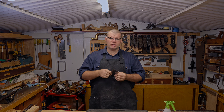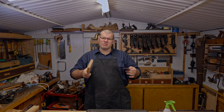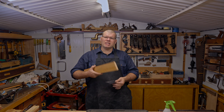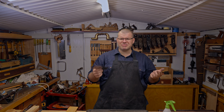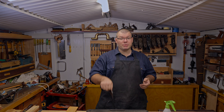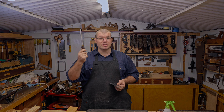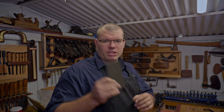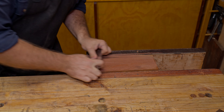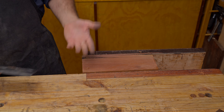I'm going to break this down into two sections. There's a more rough way of doing this if you're just doing rough removal — removing finish off something, or doing a bigger area that's not your final finish — and we can create what's really a quick burr. We're going to do the quick burr first, and then we'll move into how to actually turn the burr for a finer, more refined result using the burnisher. Just before I show you the first process, I want to show you the state the scraper is currently in — we're not really doing anything more than just pulling a little bit of dust off it, and that's to be expected.